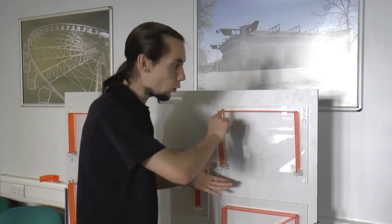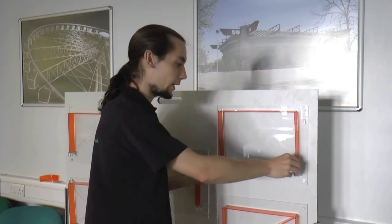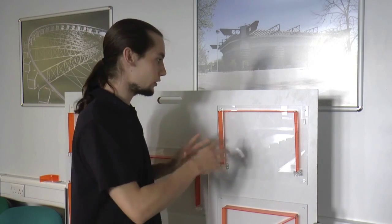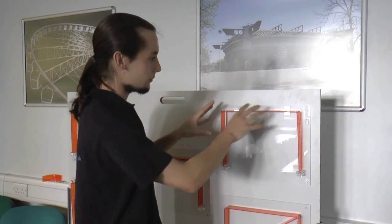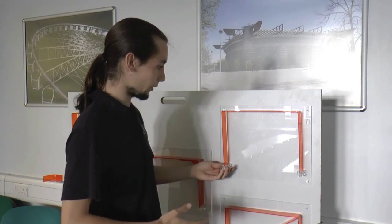We're going to model the bench as a portal frame, which is basically this goal-shaped structure you see here. We're doing this because when we incorporate the legs of the bench into our analysis, we get a relationship between the seat and the legs, and it gives us a more realistic analysis, although it's a little bit harder to work things out.